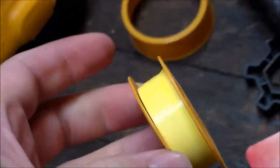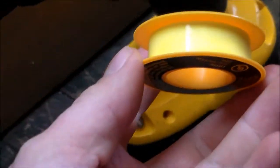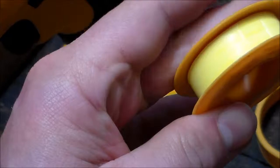Let's get this all taped up. One more thing — if you're using Teflon tape, you're signing your own... well, air on the side of caution. Get the proper stuff, people. There is actual yellow tape that is made for gas. We're using propane — it's a gas, no matter what. Just get the proper stuff, please. I've seen other videos where people just use Teflon tape. Your choice — just be careful. This is the proper stuff.